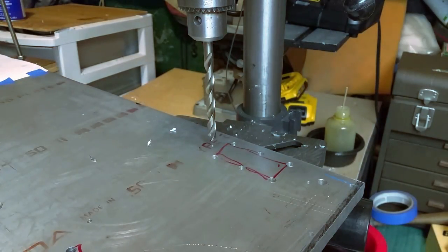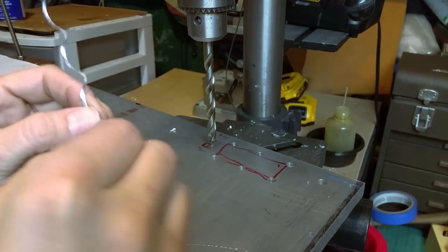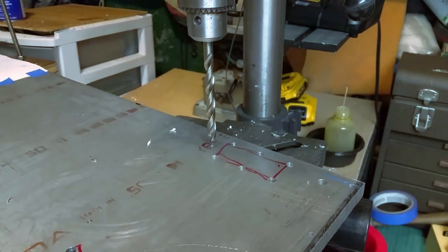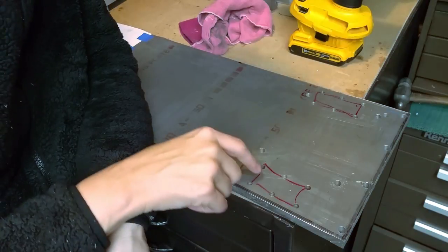This aluminum drills really nicely in that it doesn't have tough spots and soft spots, and it's very homogeneous. It's nice aluminum, but the chips it makes tend not to break. It has good tensile strength. It's tough, and so the chip comes off like this. The other 6061 aluminum I've drilled acted like this. And this, I guess because of its annealed state, just seems to hold together better. So that has its good points and its bad points. With the holes in this workpiece drilled, I'm going to countersink all the holes.